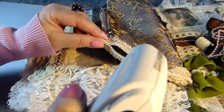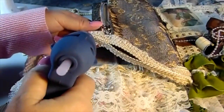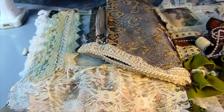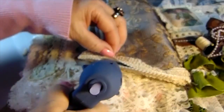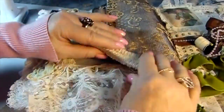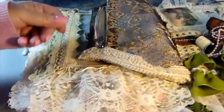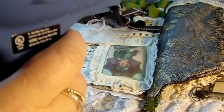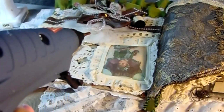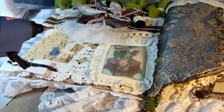So I'm switching now. And it's hot too — you want to make sure you let out a little bit of glue because it was sitting there and I don't want burnt glue. It was orange coming out, so I always squirt out a little bit to make sure the glue is nice and clear when it comes out. Now I'm going to do the other side, checking all the way up to make sure it lays down really nice.